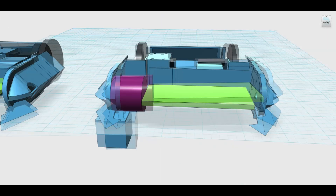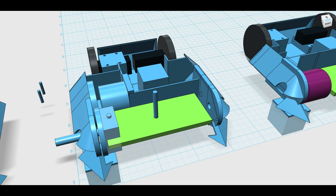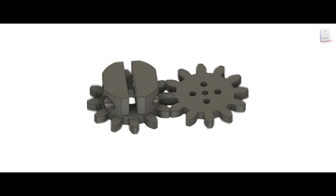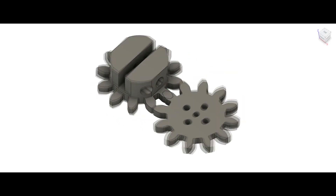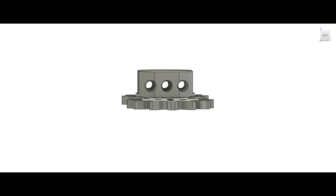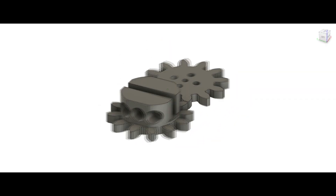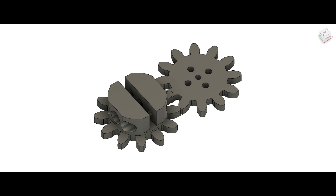As much as I really want to do this because I know that it can be done, this just does not feel like the right way to go. So instead we are going to try a different system where the motor is more protected. But instead of doing a belt, because I still really don't want to do a belt, we're going to do something different - gears! So this is just a couple of very basic gears done up in Fusion 360. One of them is set up and ready for the brushless motor. The other one I'm going to mount the weapon blade into using heat insert nuts on one side and let the bolt sit through the other side. I'll probably just duplicate that for both sides. Anyway, it is time to print some of this stuff up and do a test.